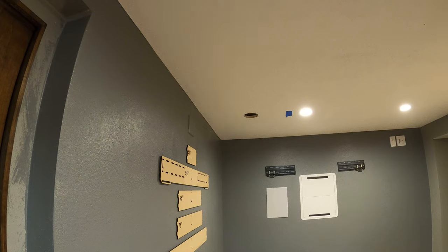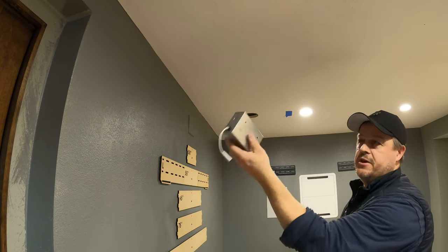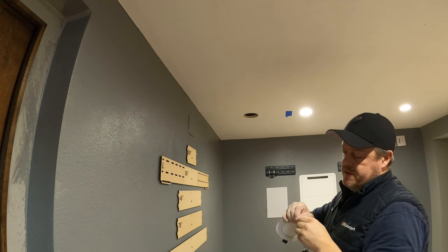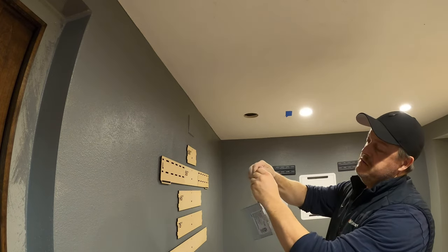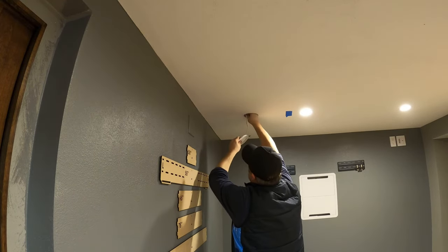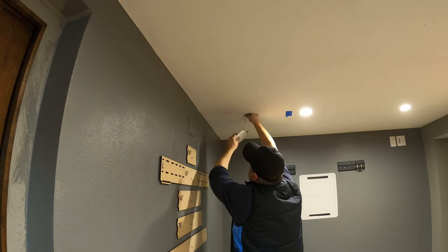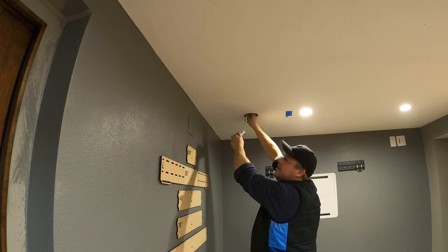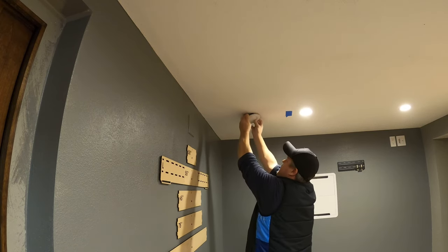The cool thing about the Brio from American Lighting is that even if you weren't a licensed electrician or you were a homeowner, it has half-inch knockouts in a bunch of different spots. It wires in with Romex — there's a little keyed insert that plugs in, and then you thread this over and it locks in place. This guy slides up into your ceiling, and I like to slide it over so it's flat. If you're doing this in a home theater, you'd put some double-back tape on it so it can't rattle. In this demo room we're not going to do that — pop the wings up.